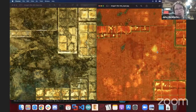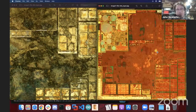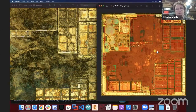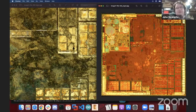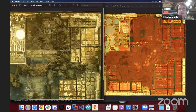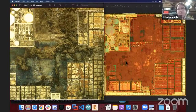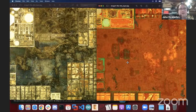Yeah, that reddish color, though, I indicated I thought was most likely due to a thick oxide layer that you were still seeing across the chip. Which we found out later on actually wasn't the biggest deal. In fact, this stage could have been fixed. Yes, I would agree with that. As long as you still have that oxide layer on top, and as long as you only care about the ROM below, the one on the right was still salvageable, I think. Assuming that was the original oxide and not something that you redeposited on the chip.